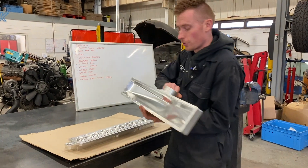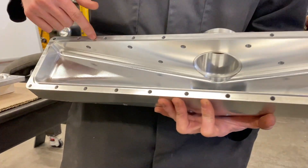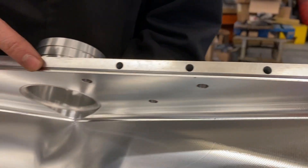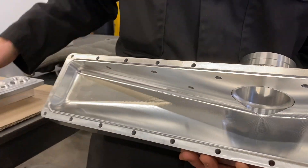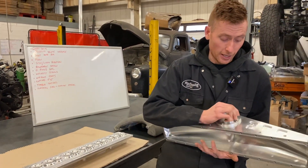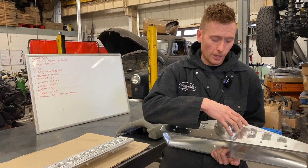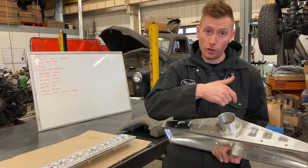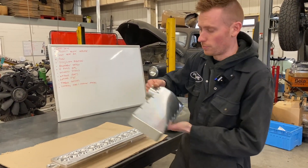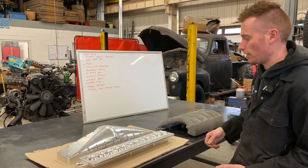As part of the lid, we've also got an o-ring. The complete bottom of this lid — you can see how thick the construction is — carries a 3mm o-ring. That allows us to seal directly onto this nice thick base plate. This section here, which is removable, you can get different sized ones — these are also trumpeted. They have an o-ring on them also, so they can be removed and replaced without any problems time and time again. You don't have to put a new gasket on every time you take the lid off.